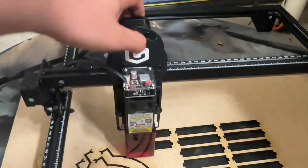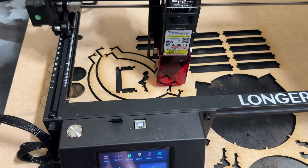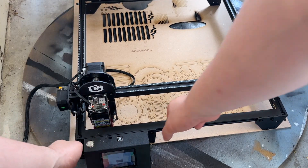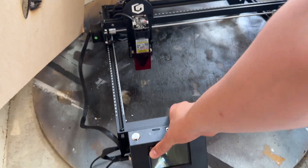One of the big things is homing. I found it quite tricky to home it and just get it where I wanted. I wish I could just move the nozzle to where I wanted and click go. But I get it — it's an easy thing to do, I just haven't mastered it yet. The machine has the ability to set where the home is when you set it up in the slicing software. One thing I noted — I had it on the concrete floor and then put some plywood under it, because as it was cutting it would go through and mark the concrete floor. Which isn't a big issue since it's the garage floor, but it is worth having something under the printer. Make sure you're wearing your glasses too — you don't want to damage your eyes from the laser. Just make sure you read the manual. Do as I say, not what I do.